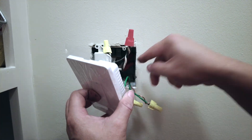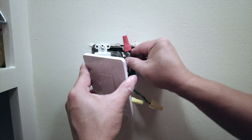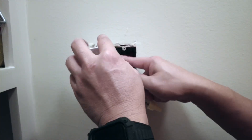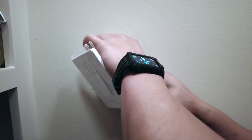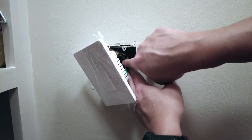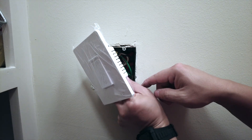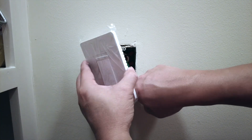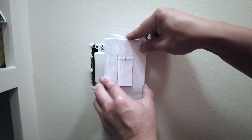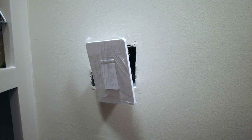I'm going to start organizing the cables to be tucked in neatly, one by one, so that I can push the new switch into the current opening. Smart switches are often larger and take up more space, so you want to make sure you tuck things in correctly. Don't just push everything in jumbled — fold the cables neatly so they take up the space evenly inside, and when you push the new switch against all the cables, it will compress in a natural way.